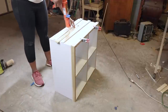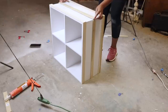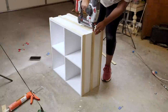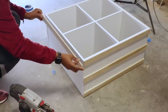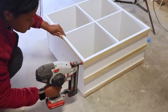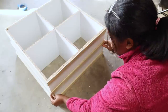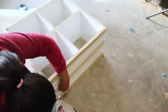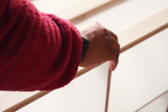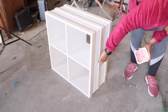I got into a groove — added liquid nails, smoothed it out, put the pieces on, and nailed them into place. For the bottom, I just did cross cuts instead of bevel cuts since it sits on the floor. It still looked great because it has like a waterfall effect, similar to countertops with a little drop-off. After finishing the bottom, I started filling in all my nail holes.